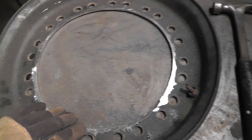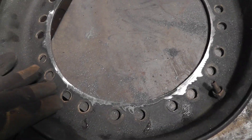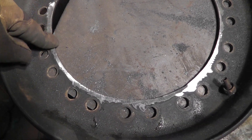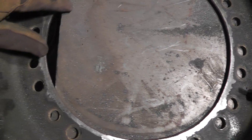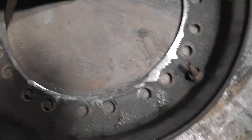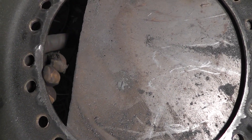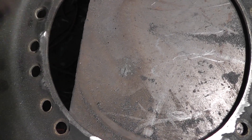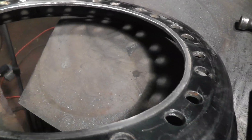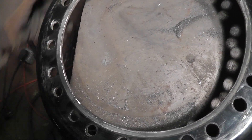I'm not going to show you me grinding all of these wheels because that's pointless — I already showed you the cutting. Basically, because of the torch angle or how I'm coming across, sometimes there's a little lift and the cut's not quite even. So I'm coming back through with the grinder, grinding off that little raised lip so it's all nice and flat on the inside, smoothing up the transitions. There are a couple of piercing marks and rough areas where my hand was shaking from the vibration, so I'm just cleaning all that up and making it nice and clean.